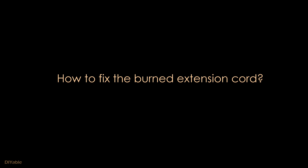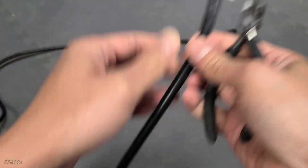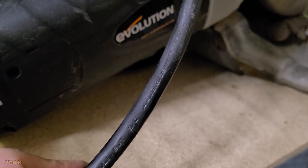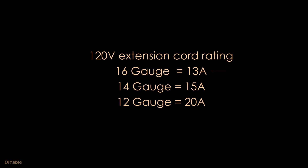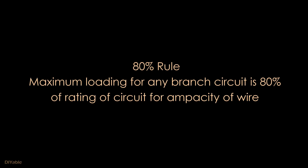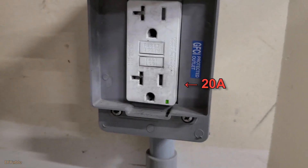Going back to my central vac extension cord — it's a waste to throw that away, so I'm going to fix it. Pay attention to the label on the cord: it says 13 amps and 16 AWG. According to the table, 16-gauge cable is rated at 13 amps, so you can use a 16, 14, or 12-gauge extension cord and be fine. However, if you have heavy-duty machinery and the cord says 14 AWG — meaning it draws 15 amps — and you go out and buy a 16-gauge extension cord for it, the plastic on the cord will melt and potentially start a fire. Because of the 80% rule to avoid tripping the breaker, you should use a 12-gauge extension cord on a 20-amp breaker instead of a 15-amp. That's electrical 101.